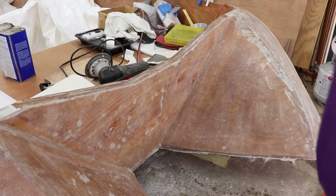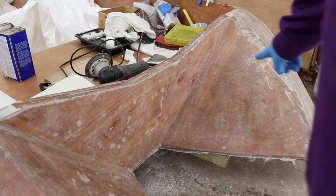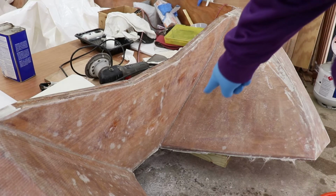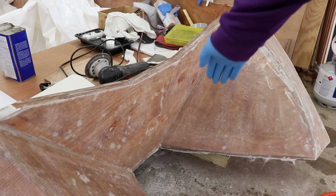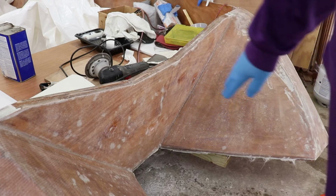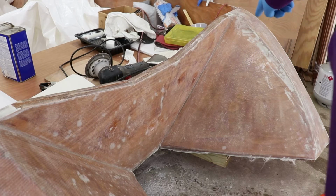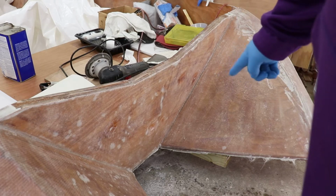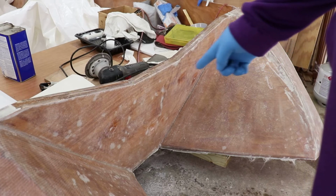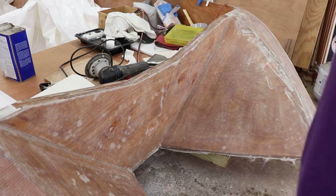We got the heater going. It feels fairly warm over here. I think because of the orientation of the camera, we're gonna go ahead and start on this panel right here and go here from the top. So we're gonna mix up some putty. I'm gonna get my straight edge and just basically pull straight down and then pull this way away from the transom. And then we'll go up here on top of the sponson and then go down the sponson. So that's the idea. Then I think I'll see how far we get. Might get this whole thing covered, do the transom, and then we'll flip the camera around and do the other side. So that's my game plan, and we'll see how it goes.